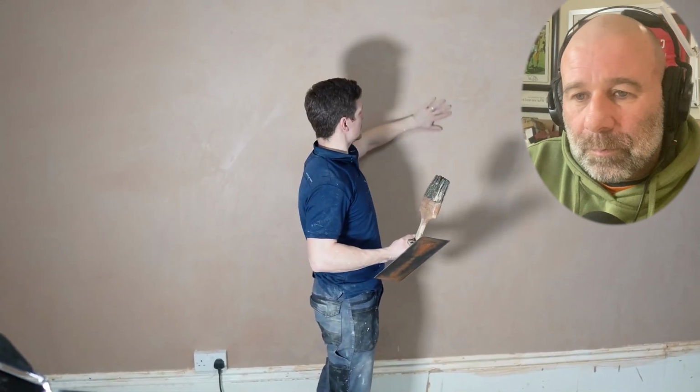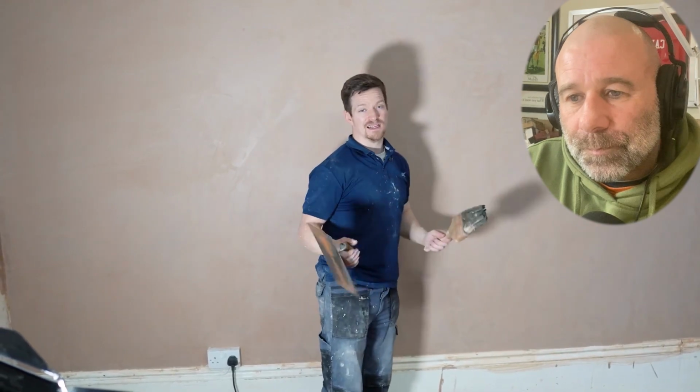If it's cold and hard, I mean, it shouldn't be that cold. How plaster sets is hydration, which heats up. So if you've ever felt a pile of plaster, it'll be warm, it'll be hot, because when you add water to it, it hydrates. Then over time, as you're smoothing it, the water vapor comes out of the wall and it goes back to its solid form. So it's just Harry Potter magic stuff. That's all it is. But I suppose it could be cold if the room's cold on the surface, and you only know that by running your fingers. You'll see it, but generally, it's pretty much set.